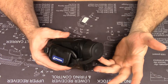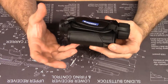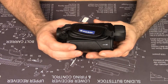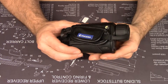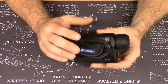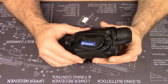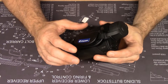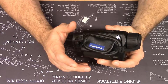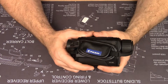You can think of the Axion series as miniaturized Helion monoculars without the modular objective lens — you cannot remove the objective lens. This device, like other thermal optics, detects medium to long wave infrared radiation. It uses a microbolometer to translate those wavelengths into electrical resistance, and then software in the unit shows you an image on the screen through the eyepiece. The Axion line uses Pulsar's new 12-micron core, but the sensor is 320x240.